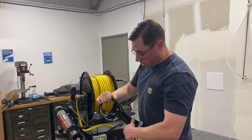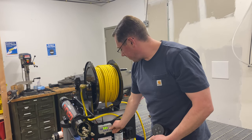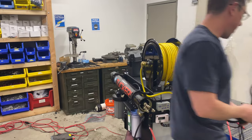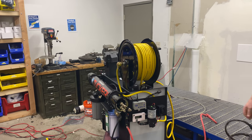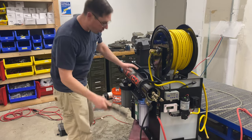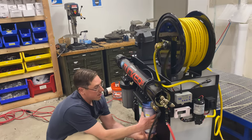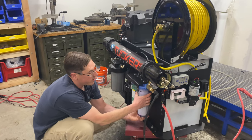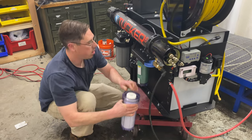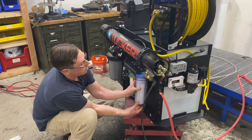Your system will come with two filter wrenches which will allow you access to your in-line filters. Here's your two-and-a-half-inch wrench for your two-and-a-half-inch filters. They develop a seal after they've been sitting for a little while. Unthread the sump, order your new filter or have it on hand, and replace it. You don't need to use the wrench to reinstall — you can just hand-tighten it and it'll seal.